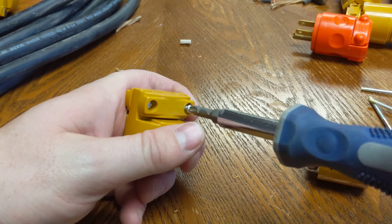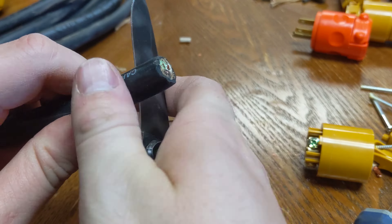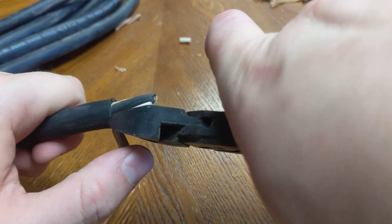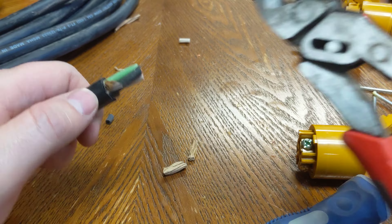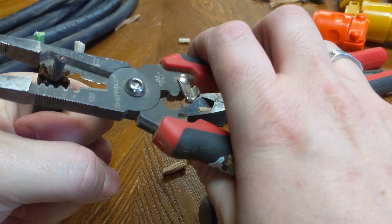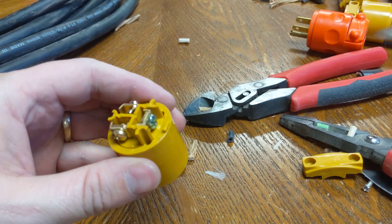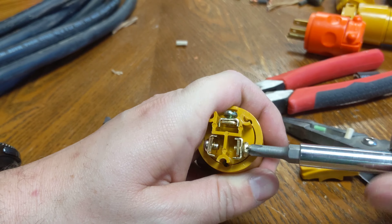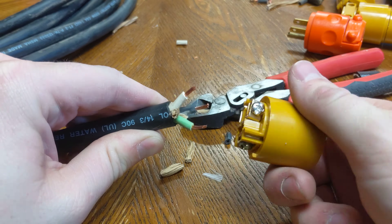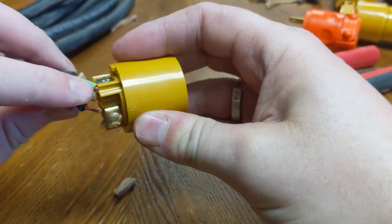Here we're starting on the female end and pulling out the useless screws — I ended up replacing all of them with modified drywall screws. Not something I'd recommend, but it works. You can see how much less of the outer sheathing I ended up cutting away, and that's really what you need to do — just pay attention when you first start. You want to make sure the outer sheathing goes into the socket when you're all done. You don't want the wires poking out of the connector, because when things start moving and flexing during use, that's where it's going to break and cause a short.